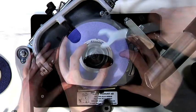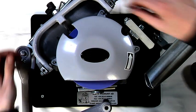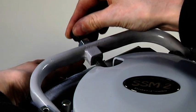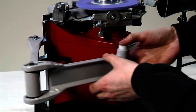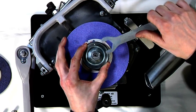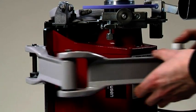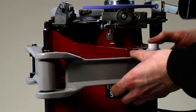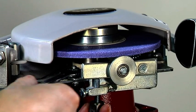Fasten the grinding wheel in place with the balancing ring having the same eccentricity as before. Start the machine and dress the wheel. If the grinding wheel still vibrates too much, fine-tune it by moving the balancing ring incrementally towards the middle, outwards, or sideways until the vibrations have virtually ceased.